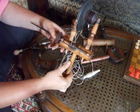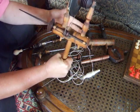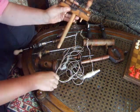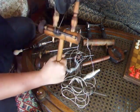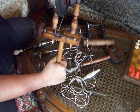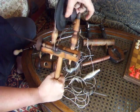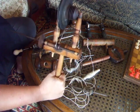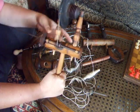I generally refer to these by the generic term 'accelerator,' just because it accelerates. This is designed to go into a female mount, as you see with Shaker wheels and others. The Shakers actually made wheels intending to put only accelerators with them — you notice just a very small drive here. You don't take the drive cord directly to the spindle for an accelerator; instead, you drive to one of these, align with one of these, and the drive cord turns this big pulley — because that's all one piece — and that drives the spindle. When you drive a second wheel and that second wheel drives a third wheel, you essentially double the speed of the final wheel, and that's what the accelerator does.